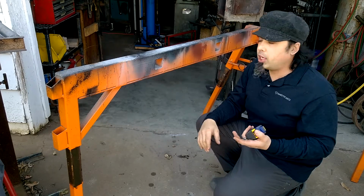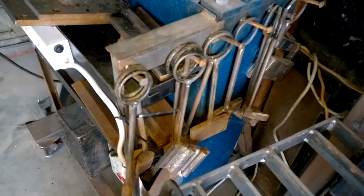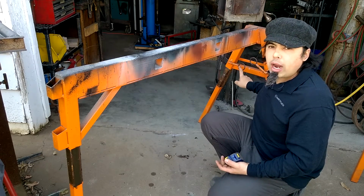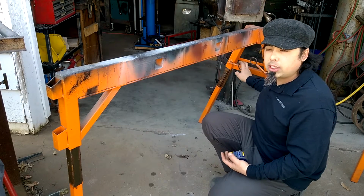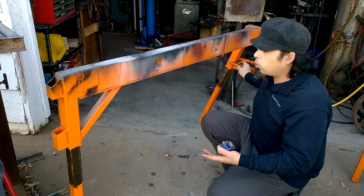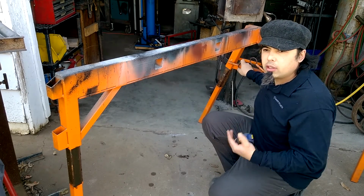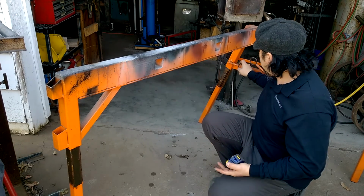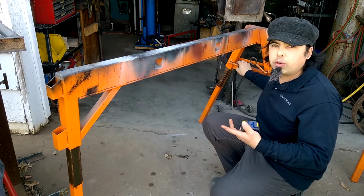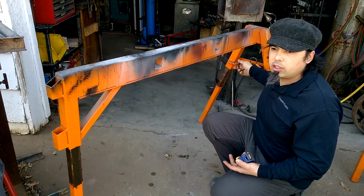If you've seen my videos, you'll notice that these rings are everywhere on handles and things that I hang. This comes from scrap garage door springs. It's spring steel that I MIG weld to mild steel using mild wire, and I've never had them crack. It's never been a problem between the carbon steel and the mild steel. And so I highly recommend doing this for non-critical stuff that you just need to hang, or it's nice to have a big fat handle you can grab onto.